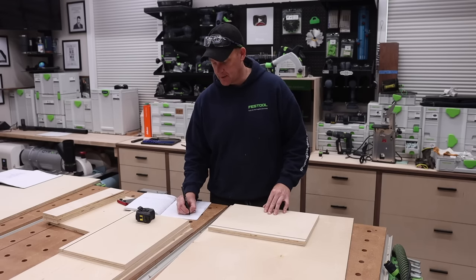Let's clip this door in place and make sure everything lines up. Once it's lined up, it should just snap into place. Go ahead and close it. The only thing left to do is make some minor adjustments — right now I'm pretty much flush, so I want to come over just a couple of millimeters and possibly up just a little bit.